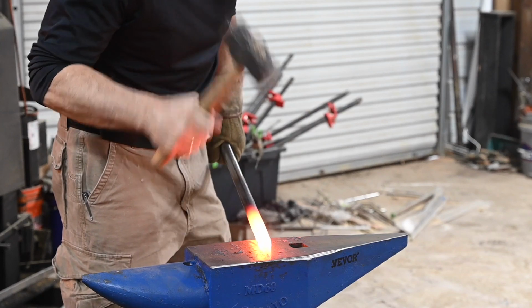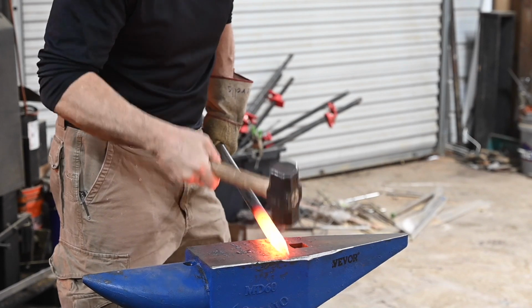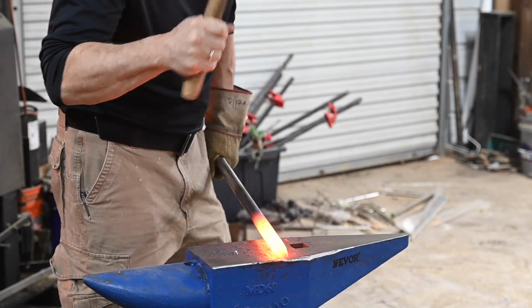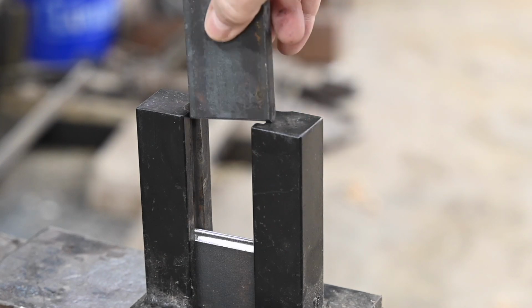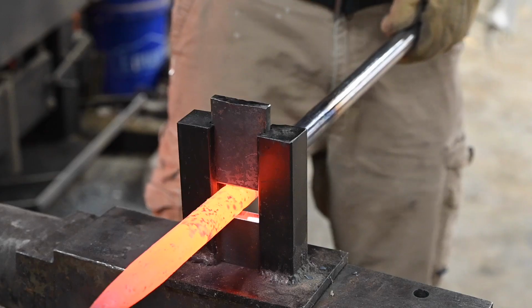So, what I'm doing now is pre-forging the tapers here, first by forging a tapered point, and then by flattening it out. Before I form the flats though, just for reference, I'll use a guillotine hardy tool to neck down the point where the tang will be formed. This is not necessary at this point, but is really just to show me where I'm aiming.